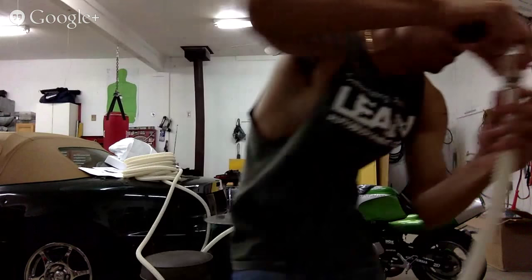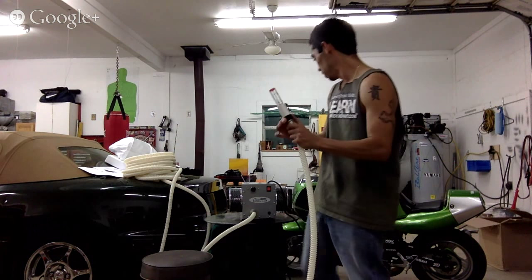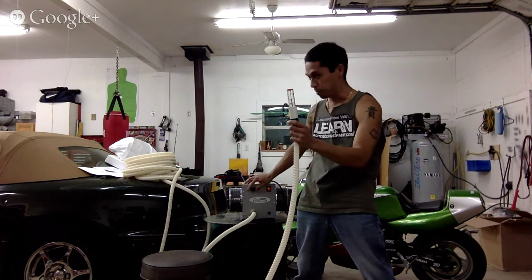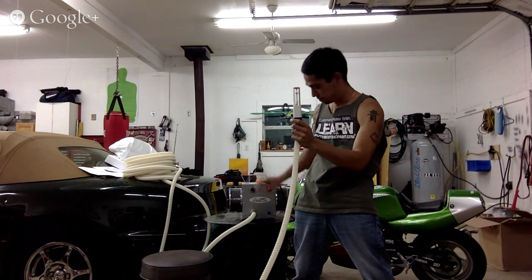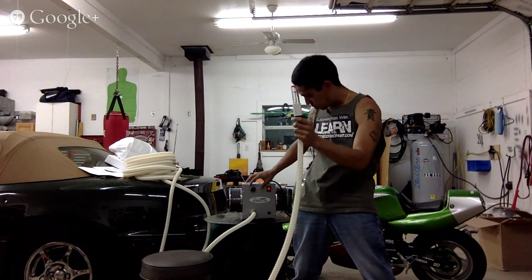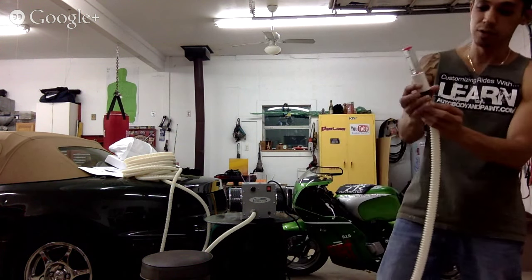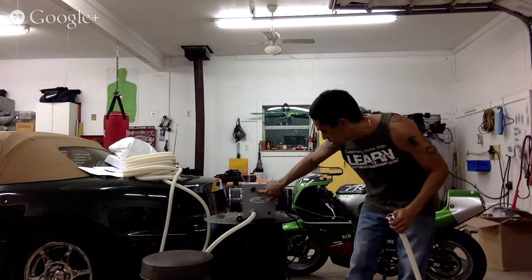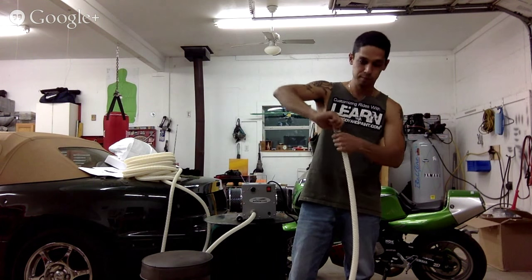Gonna take this quick disconnect off. All right, we're gonna go ahead and screw this on. Turn the machine on. We gotta turn it up so it hits 6 CFM. Okay, that's it. Now we could take this off, and you want to make sure you keep this unit, because if you have to set it again, you have it. What I would do is mark this box here with a little line, knowing that's where we got to go. And I'm going to put this quick disconnect back on. Okay, pretty easy setup.